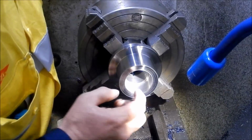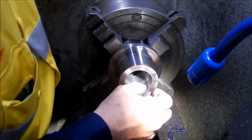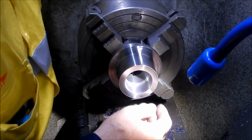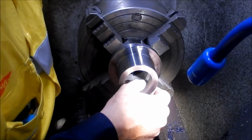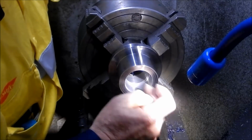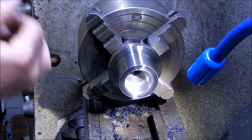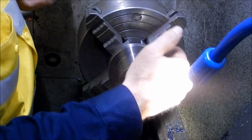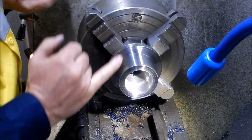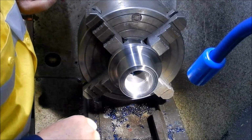Alright, I'm just going to undercut in there by a couple of tenths just to give us a bit of clearance on that cup, so that I'm not pushing it all the way through or punching it all the way out. It has to be maintained. So I'll set up and do that now, give it a touch with a bit of emery, we'll deburr it, and then we'll get set up for doing the PCD holes in here, and I've also got to cut a slot for the motor support anchor, which has got to go in there as well.